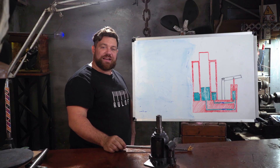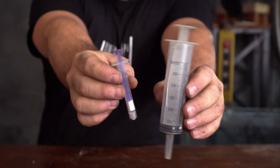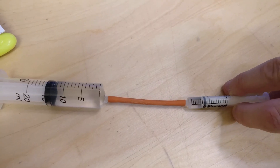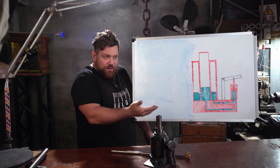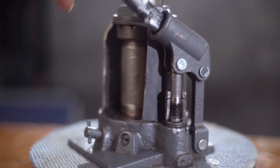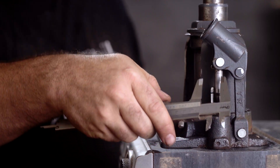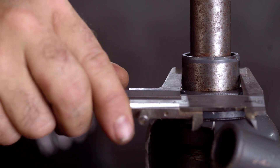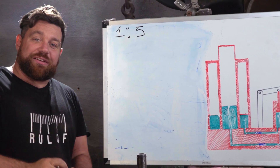You can clearly see this with a simple experiment you can do at home: take two syringes with different dimensions - a small one and a big one. If you push fluid through a tube, with the small syringe you have a lot of travel, and with the bigger one you have very short travel but a lot of force. This is exactly the same thing as the rope and car lift analogy. Now, the best way to understand everything is to calculate it - using my caliper I can measure the pump piston here, which is only 1 centimeter, and the big piston that lifts the car measures 5 centimeters, giving a ratio of one to five.